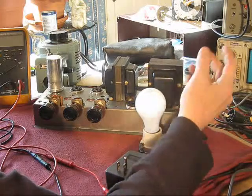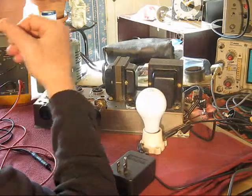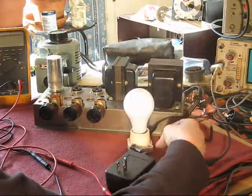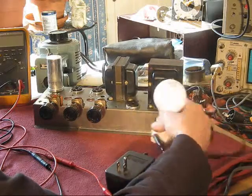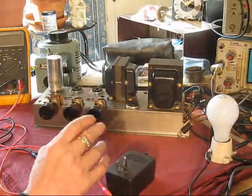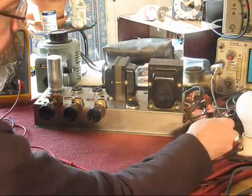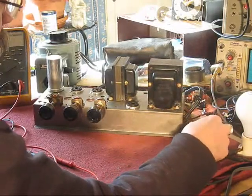And as you know, I could start off lower, 60 watts, for something like this I find it pretty useful. Usually, if I don't see any serious troubles, I'll go from a 60-watt ballast directly to no ballast and see if anything smokes. Depends on how much time and money I've spent on the thing, but this, it cost me nothing.